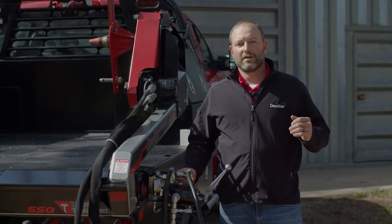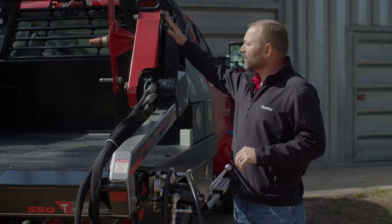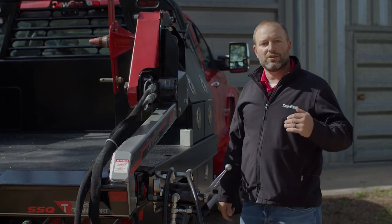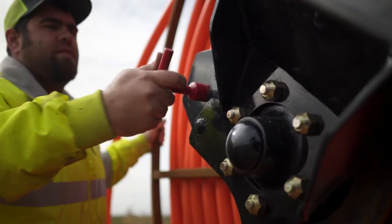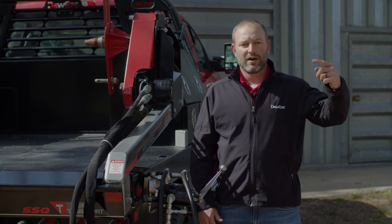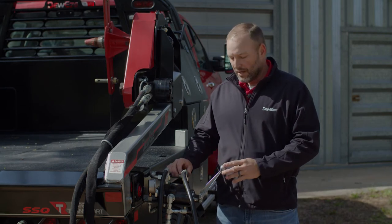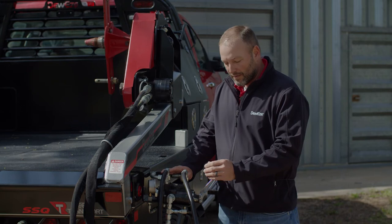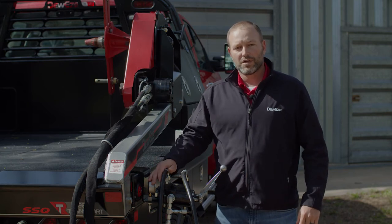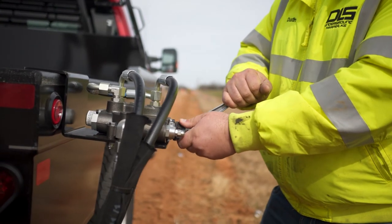Next, here is a little bit of the nuts and bolts on how we're actually manipulating that reel. What we have up here is our riser and spinner assembly. It has an integrated brake that you can adjust to limit the amount of backlash you may be experiencing, or if you want to pull under tension. The main difference is that we drive from the center of the reel, not from the outside. When it comes to the valve and how you control speed, we have a flow control that allows you to adjust the speed you're taking up or paying out. We also have an integrated pressure gauge so you can monitor the amount of pressure you're pulling on that fiber as you're installing it.